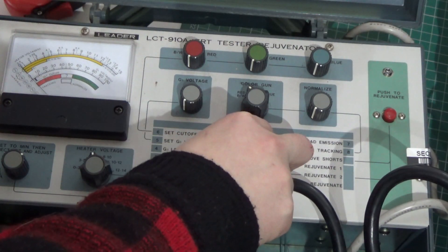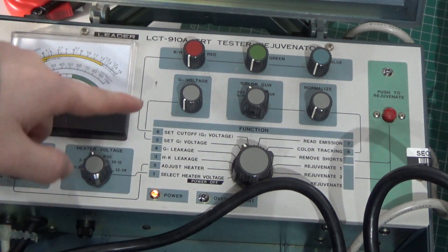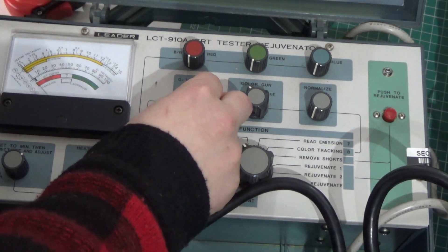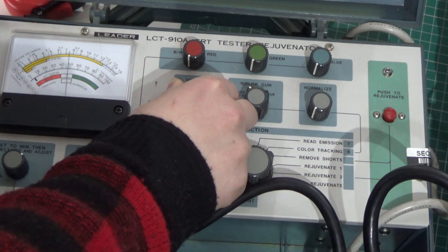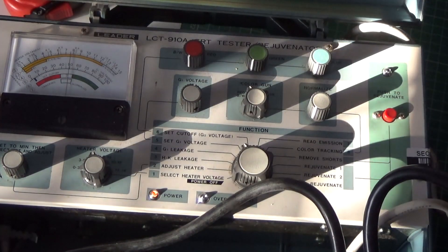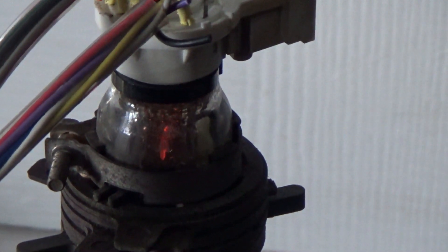Then we want to go to set G1 voltage. G1 voltage is for the screen brightness, and that is also on the website — I'll link in the description; it tells you the G1 voltage that the tube uses. G1 voltage is here, so I'm going to change this until it goes to 50 volts because that's what this one needs. There we go, we're at 50 volts. At this point the heater is lit. I'm going to turn the lights out and show you the tube — hopefully you can see the net glow. And there you go — you can see the net glow. That's showing you that this adapter is working and the heater is on.